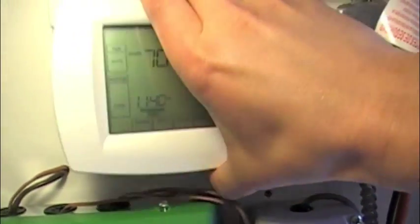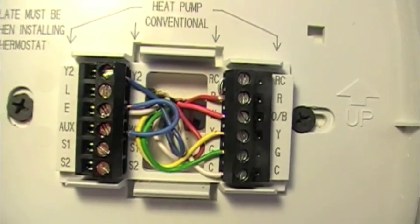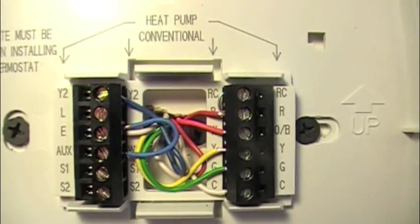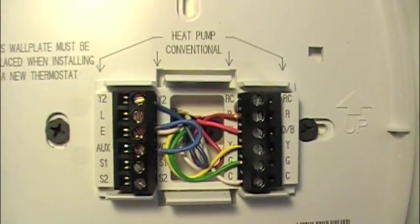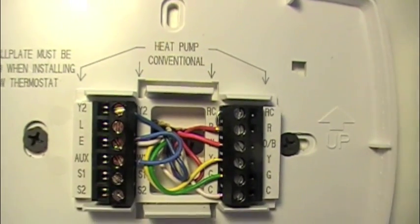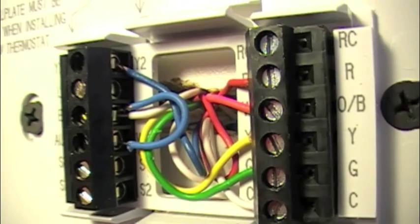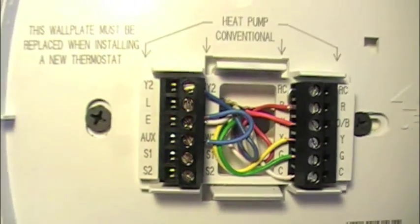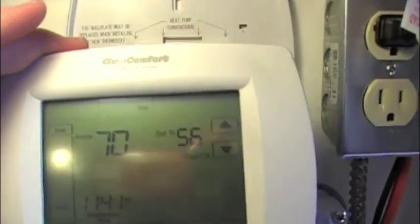Let me show quickly how we've got the thing wired. The special thing to be aware of is that I use a blue wire as a jumper between the E and the AUX terminal. If you're following the heat pump wiring — the outer terminals — there is nothing designated as W. W is often what we designate at the heat pump to run the auxiliary strip heat. So in this case, the heat pump terminal often labeled W is going to wire to the E and AUX terminals, which I have connected with that jumper. The white wire goes to the heat pump strip heat terminal, and the blue wire jumps AUX and E together — that's what gives us the ability to run emergency heat manually or switch on automatically if it's not keeping up with the load.